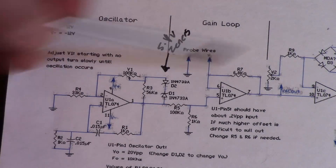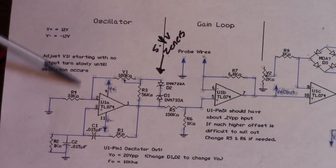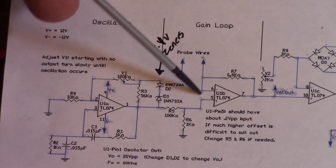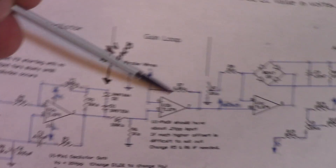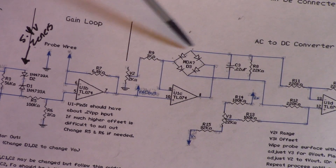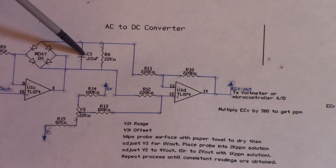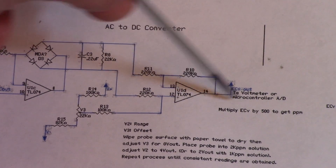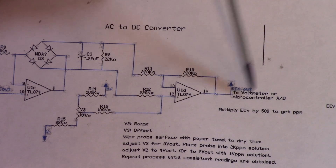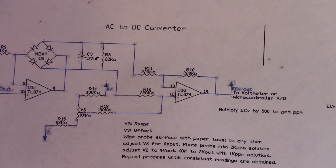This is the circuit diagram from Isabella and it comes in basically four stages: an oscillator stage which generates a sine wave signal; that sine wave signal is fed out to the EC probe in the nutrient solution; it comes back into an amplifier stage to amplify that signal, which will have shrunk down quite small by then; and then it's fed into a diode network to change it into a series of always-positive pulses — removing the negative-going component. That's integrated over a capacitor to remove the base frequency, then boosted to an output that can feed an analog-to-digital converter on a microprocessor. The idea is to calibrate this so that 0 to 5 volts out corresponds to 0 to 5 on EC.